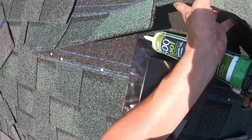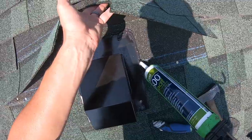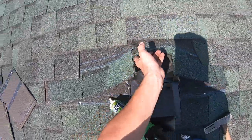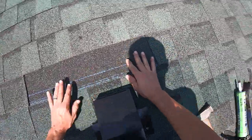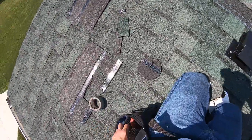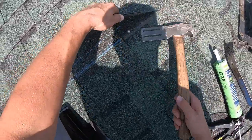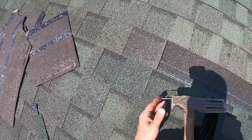Up along the top of the flange for any water running back, to seal it down the edge. This is not the only way to do this — this is just the way I do it. If it doesn't leak, you did it right. Back to being cautious of your nail pattern: don't forget to double-check the shingles you did not take out. If it needs a nail, nail it. Get your nail on the common bond where it needs to be.